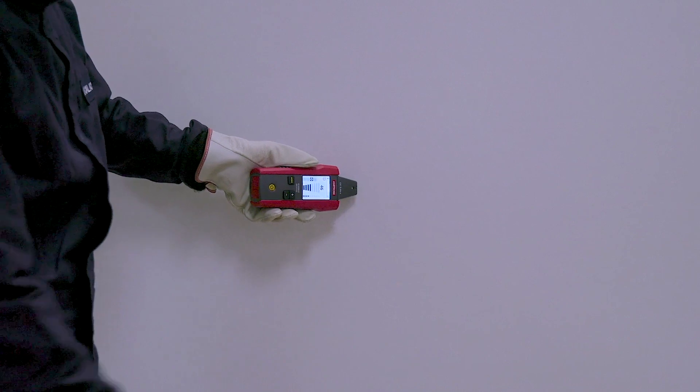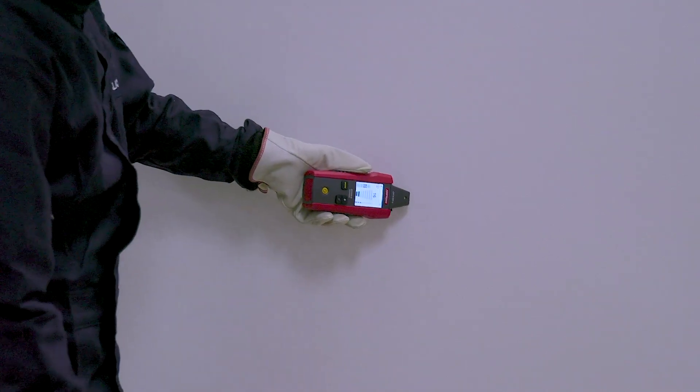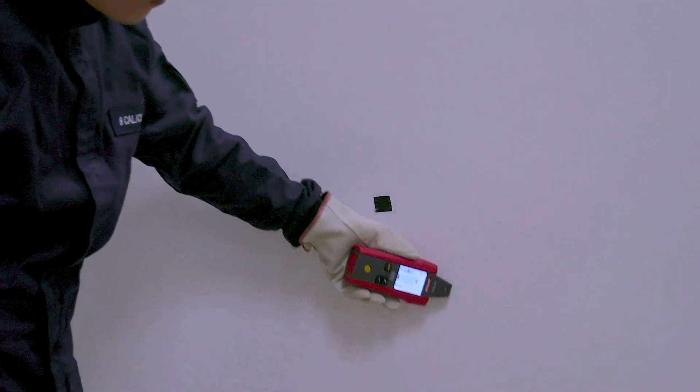This indicates the position of the wire. Trace the wire until the signal stops — this indicates a break in the wire. Move the transmitter to the other side of the wire and repeat to verify the place of the fault.